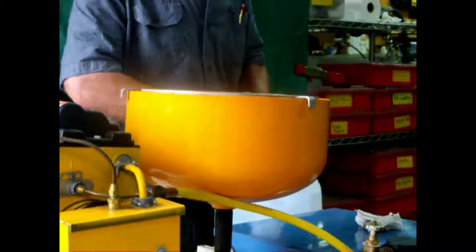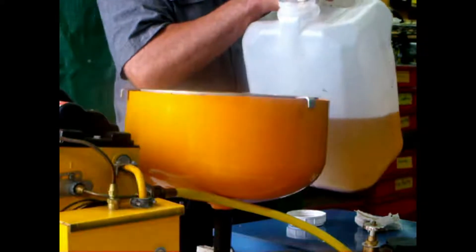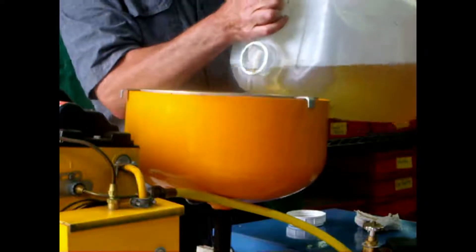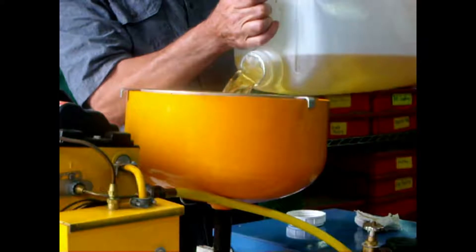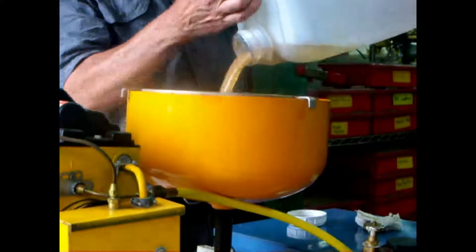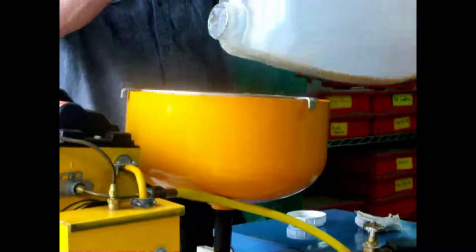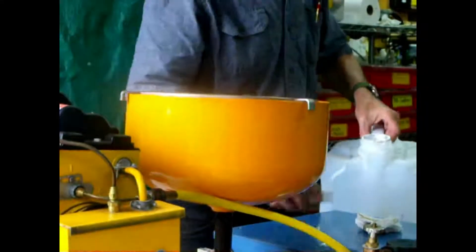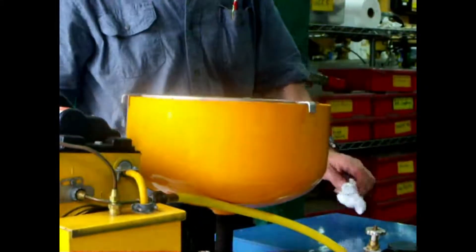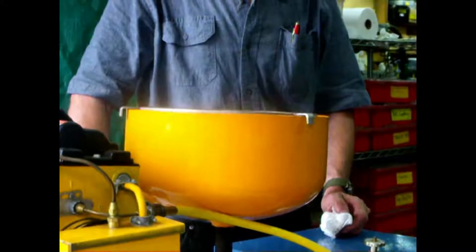Let's add some oil and show you how it works. This is the typical way that used vegetable oil is disposed of by a restaurant. It's pretty clean, but it does have some debris at the bottom of the container — but just pour it in. It's as easy as that, and if it goes through the screen, it works well. After you've poured in your oil for the day, you can see the sediment at the bottom of the jug. After the oil has a chance to settle, it's a good idea to clean the screen with paper towels so that oil doesn't sit on it for weeks and polymerize, clogging up the screen.